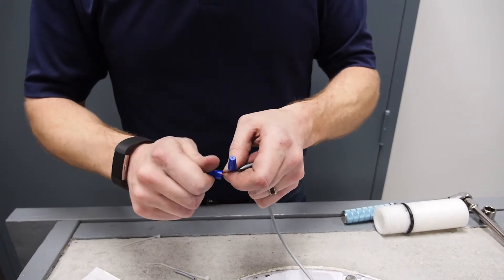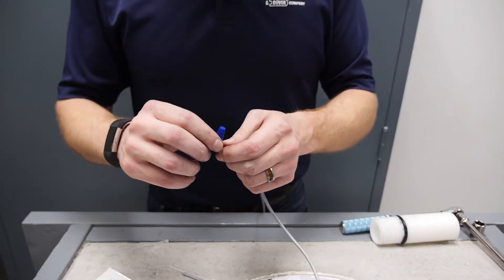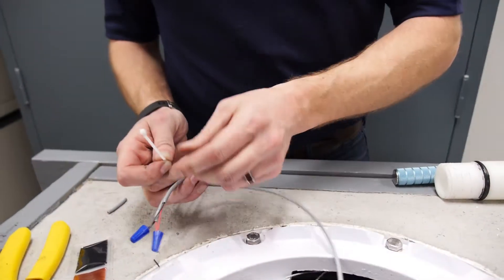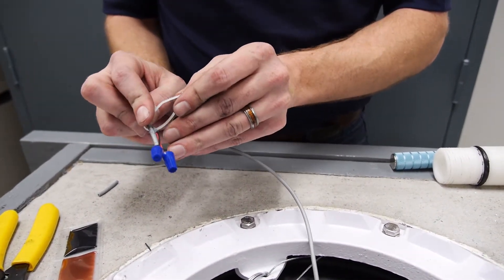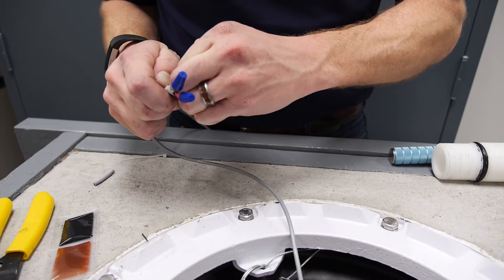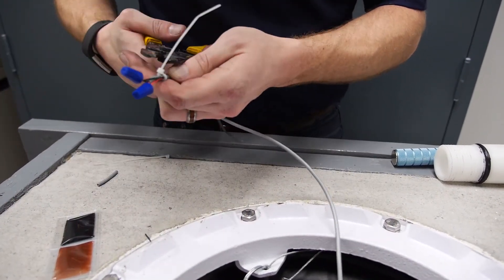At this point, before you put on your seal pack, you're going to want to take your sensor and make sure that you're getting a good signal. You're going to flip that over, make sure you go into alarm and make sure that it comes back out of alarm with no issue. You always want to make sure that you zip tie to keep those wires together and put as little stress on your wire nut as possible. Keep that down below your jacket and cut off any extra to leave yourself some room.